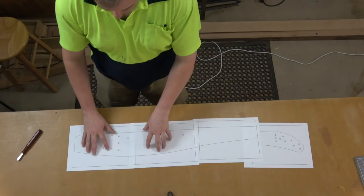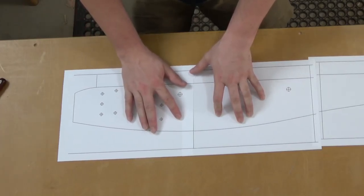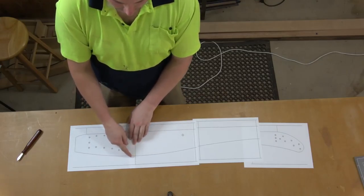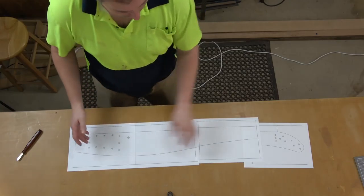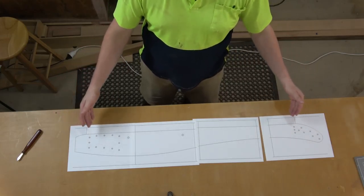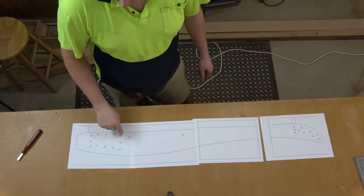I cut that off, and now I can get this page and put it directly next to that line — not on top of the line, not over the line, just right next to it. That way I'm not compounding the error from the line weight. I'm not putting a line next to a line, making the one-millimeter line actually two millimeters — it's still one millimeter and still perfect. So when this is finished and completed, if it's meant to be a meter it will finish at a meter, rather than a meter plus one, two, or three millimeters. That's important given that I've got joinery marks on here as well.